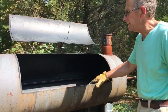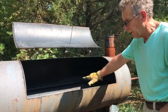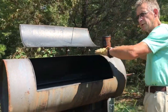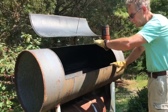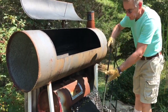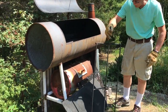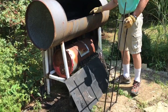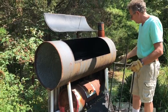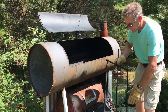We've got our frame inside — this is what our grate's going to go on — and we need a piece that we can put under that to hold up the baffle, the solid baffle between the meat area and the initial heat and smoke area. We use regular half-inch rebar, welded at the corners, made a grid, measured it up so we could get it in there and set it in above our heat duct that changes the flow from this direction back underneath.